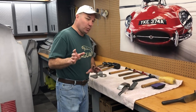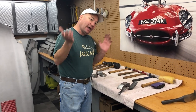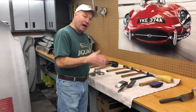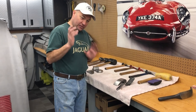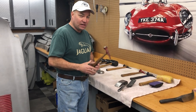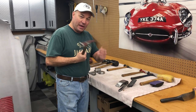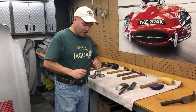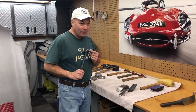Inevitably, when I do this work, I end up with every hammer in the shop over here. With the dollies, I seem to gravitate toward the cheaper ones — everybody's got their favorites. With the hammers, the expensive ones are a lot better. The heads are hardened and you won't get any dents. This is my favorite hammer here — it's got a nice little spade on it and you can reach around and get into things. This one is a cheaper hammer with a fiberglass handle. It's got a pick end on it — I rarely use this.